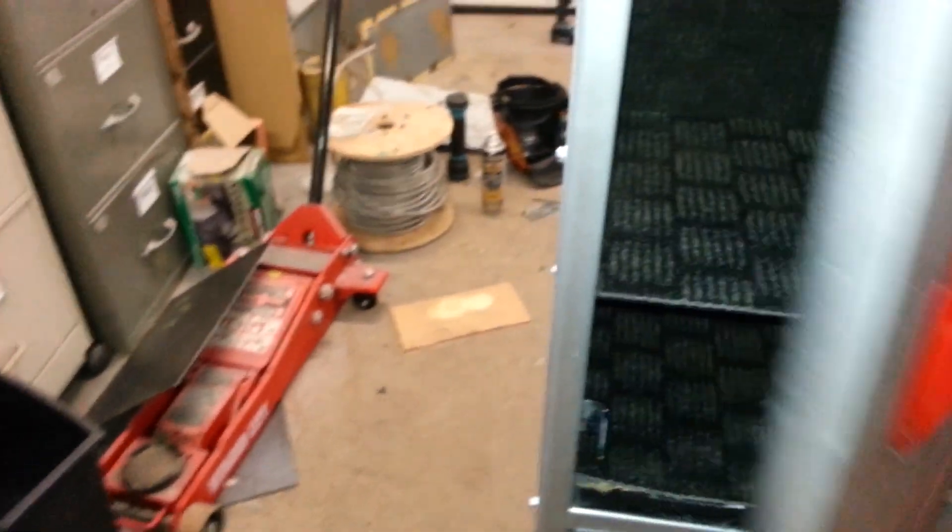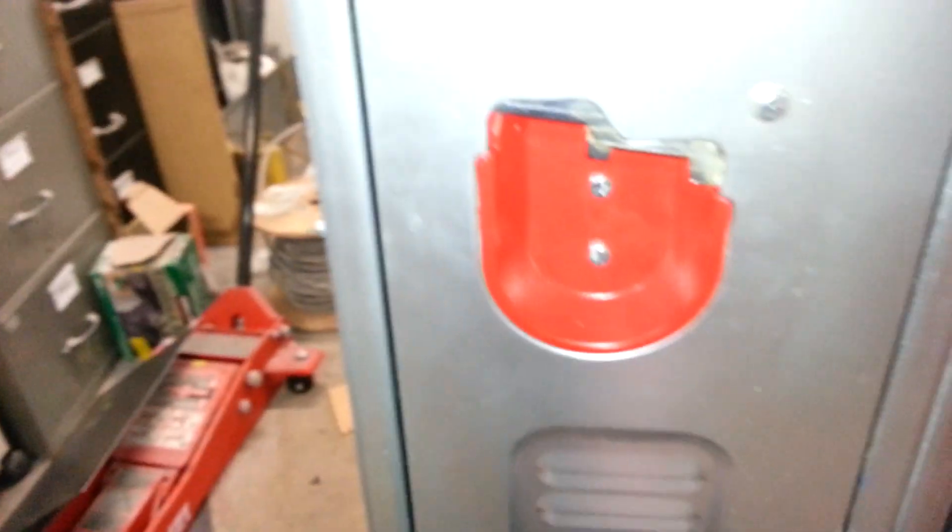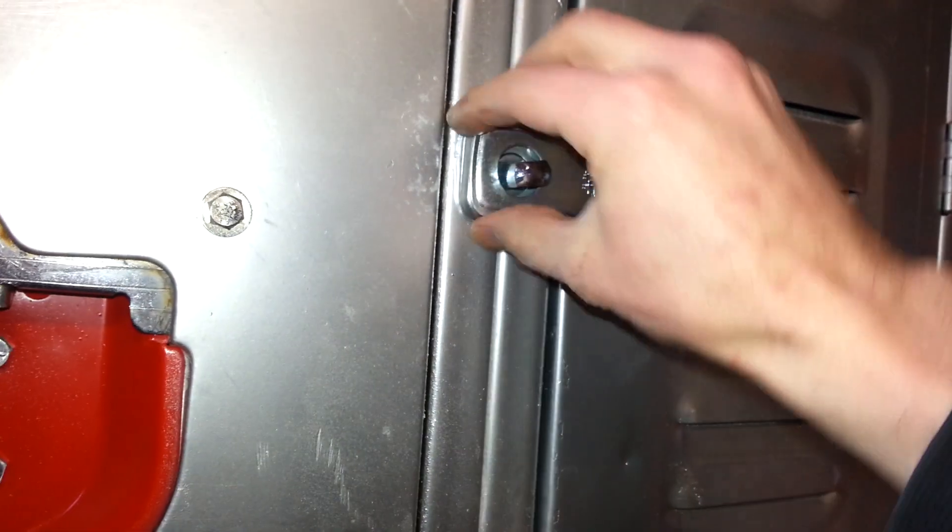I fixed the corrosion and made everything open and close nicely. Down here at the bottom I've split it into one-third and two-thirds for some slightly larger storage. That one's forest green on the side — some paint I had around — and I rebuilt the bottom. This one's bright blue. On this main door, I welded it shut because it wasn't secure enough, added heavy hasps, a latch at the bottom, and a nice big metal handle which I welded up myself. The inside is carpeted — that's the existing shelf — carpeted all the way around.